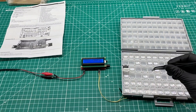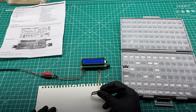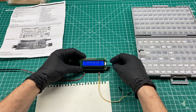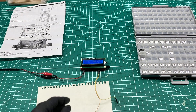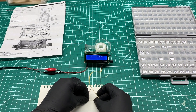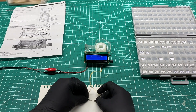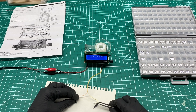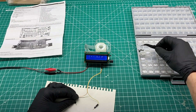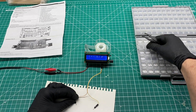When it's calibrated the screen should show 0 pF for picofarads. Let's test this out with a 22 pF SMD capacitor. I'll kick off another calibration to make sure that we're starting from a good state. This says about 23.6 pF. The tolerance of this capacitor is 5%, so I'd say that's pretty close. Something that's nice about this device is that it features an auto-ranging system, so you don't have to manually select the range for the component that you're measuring.